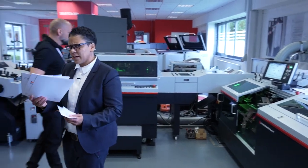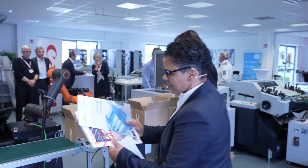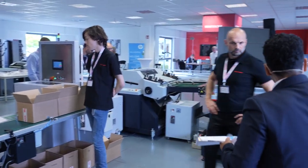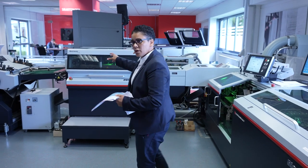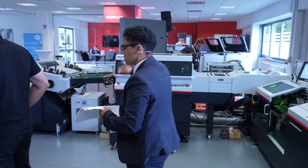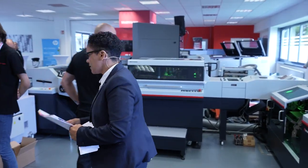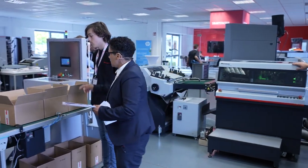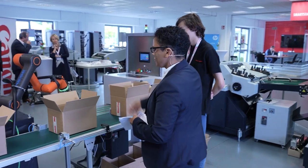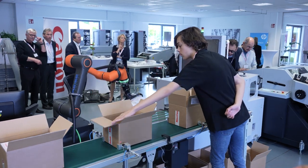What we're doing here is running applications of three different page counts simultaneously — a 12-page, 24-page, or 16-page brochure. After the booklet is stitched, we feed it directly into our trimmer, where we trim it on three sides. In this configuration, we also have our PSX stacker, where we create stacks from the booklets. We also have banding at the back, and a collaborative robot that supports us in packing the brochures for delivery.